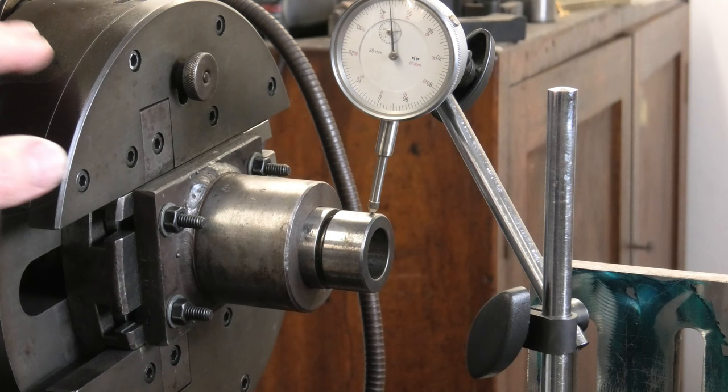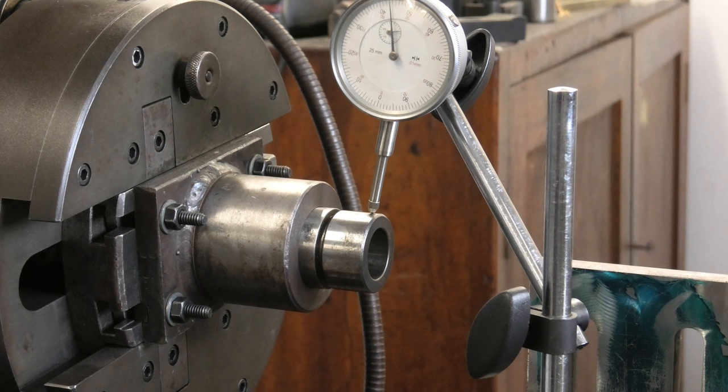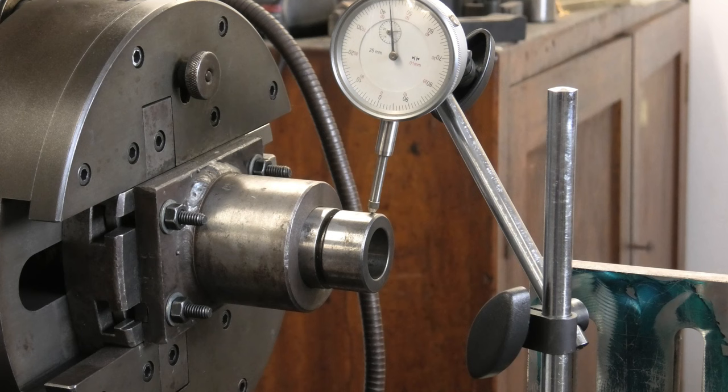I finally ground that cutter, and it's a bit of an odd bugger — it's 7 flute, and man, it was hard to get clearance behind the cutting edge. A little bit of a hint: the facet angles were brought back from 27 degrees to 17.5 degrees, and the cutting edge a little bit above centre — that helped. I've also got a new lighting system now: a studio stand with a fill light and a screen on the front. Let me know what you think of the video — is it any better? I'll come back after a break and have another go at this bloody facing head.